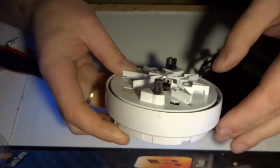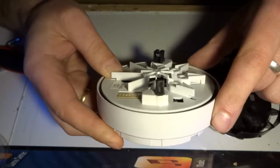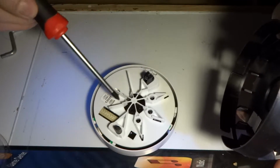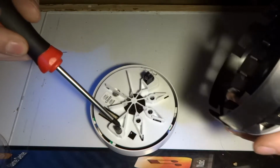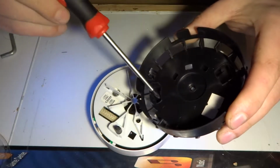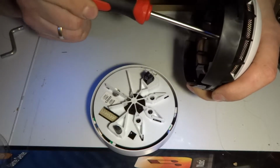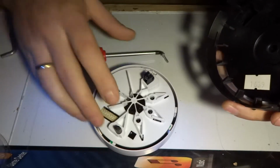But there is that's an LED that flashes to let you know that this is actually working and operational. Possibly it's gonna complain when the batteries are getting low. This diode, this LED, is in a straight line into this, which is most likely a phototransistor. And when the dome is on, those go into those two holes in the dome, and there must be some sort of light path that will get those two connected. So maybe when smoke particles get to interrupt the beam, then this will detect it somehow.